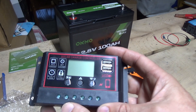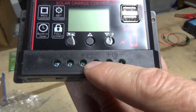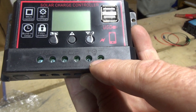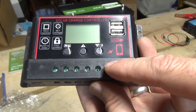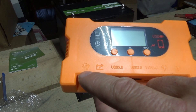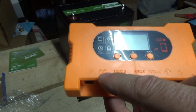This one here — I don't know how well it's going to show — but we have a little solar panel display image, here is a battery with plus and minus, and here is your load. This device will monitor the battery voltage and then disconnect your load for you — great for night lighting and such. And this one has a lot more features but pretty much the same thing. You can see this one a lot better — there's a symbol for solar panel, a symbol for a battery, and your loads. This one has multiple outputs, but again there's your solar panel and your battery. First things first, we connect the battery.